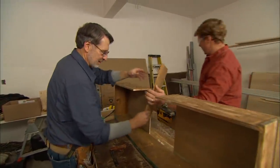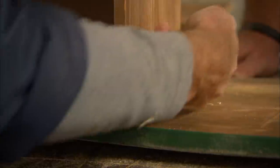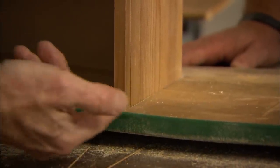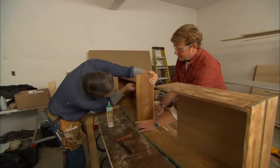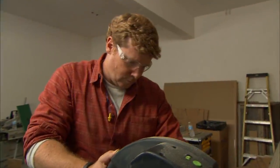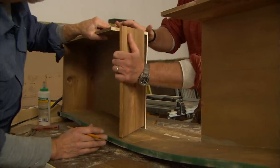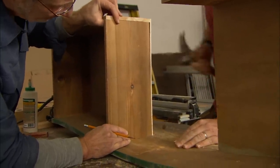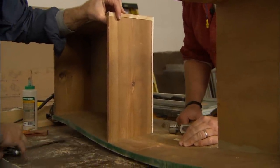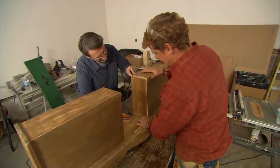The bevel's down on that — let's see how it fits. The bevel this way is good because the front tilts out and the bevel of the curve looks really good. Nothing is straight on this piece — nothing has been straight. I can mark the length on the inside and that's going to be a square cut. Now let's see how this one fits — flush with the plywood, making sure it's square to the front. Go up a little bit more — that looks perfect. Let's cut the other one.